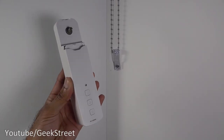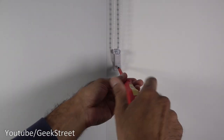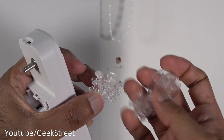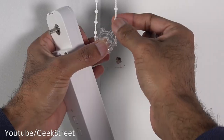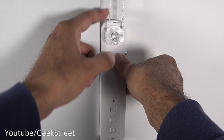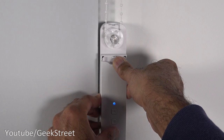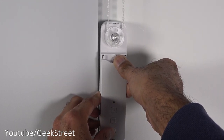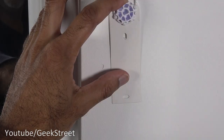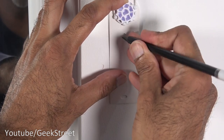Now I'm going to install this blind motor in the studio — we've got a big blind over here. First we need to remove the existing screw holding the chain. Next we test out the different cogs: go one by one to find a good fitting one. This one seems fine — once I've tensed the actual string it doesn't seem to be slipping. This is a good one to go with. Using the template, I can mark the locations where to drill.